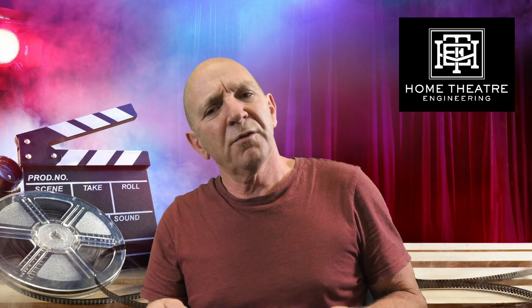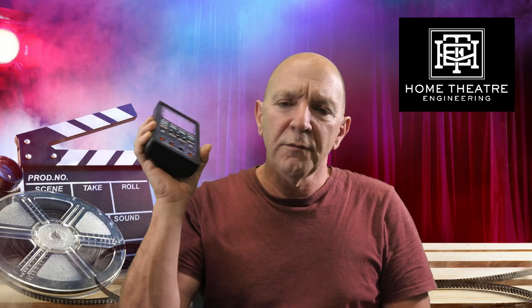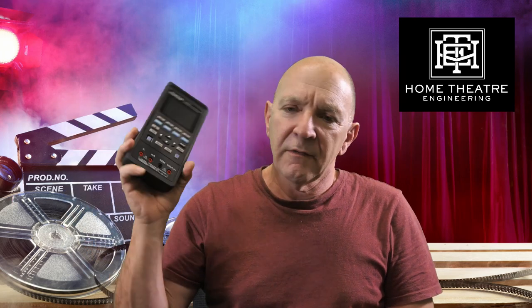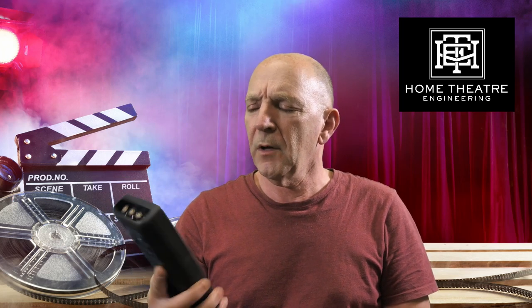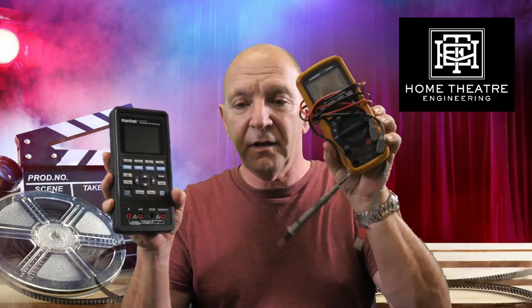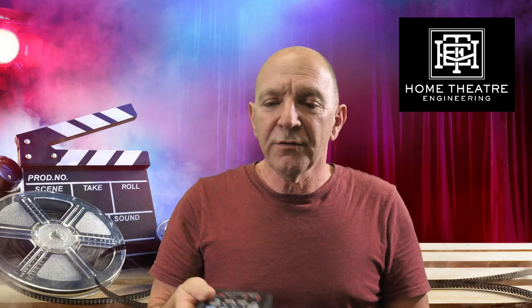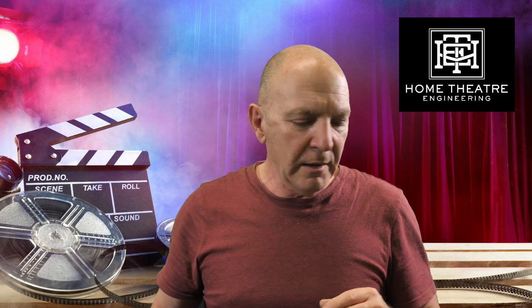My favourite toy, the one I use the least but really love, is a handheld oscilloscope. Good for testing signals, good for looking at noise or interference. This one has a limited range — I think it's 100 megahertz. But it's also a multimeter; it doubles as a multimeter and does the same things as the standard one. I've used it to troubleshoot things like ground loop issues and 50 hertz AC hum — we're in Australia so 50 hertz.